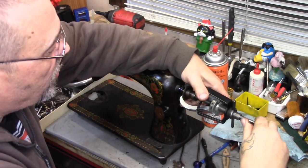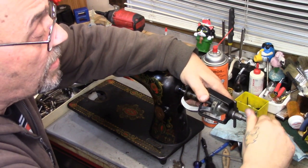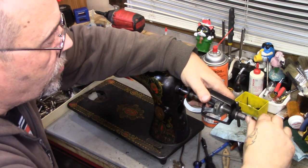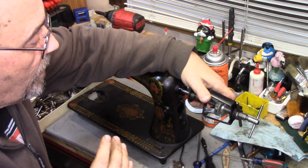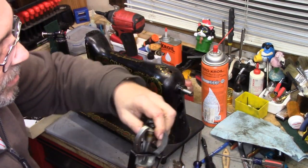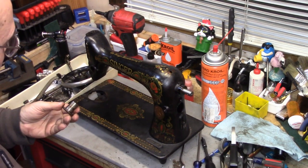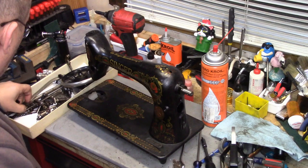I did not buy this initially for sewing machine work — I was working on motorcycles when I bought this — but it has proven invaluable. Taking the stop motion bushing right off. This is an expensive tool; on Amazon I think it's now around $136. But it is just oh-so worth it for doing this kind of work. You saw I used it to get the balance wheel off this machine. All too often on YouTube I see people taking mallets and hammers to balance wheels and I cringe — use a puller. I know they're expensive, but it got everything off with no damage, and that's the important part.